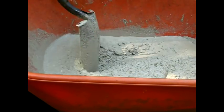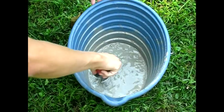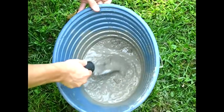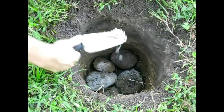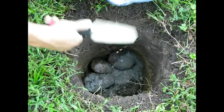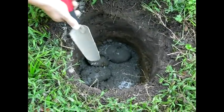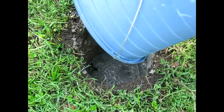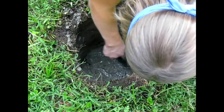If you have a hole deeper than two feet, and rocks already in your hole, then take a shovel or two of your cement and put it into a bucket. Add some additional water, giving it quite a thin texture. Now pour it over your rocks. Some of it will seep into the ground, creating a better grip for sandy soil and heavy frost conditions. If you have a standard two foot hole, you may skip this step and do not need to create this thinner batch of cement.